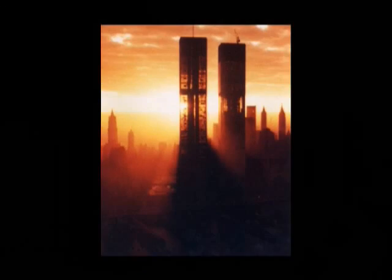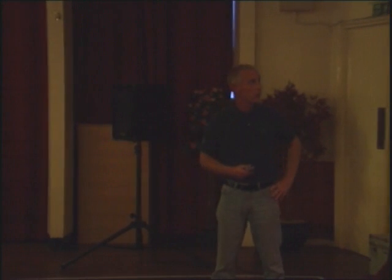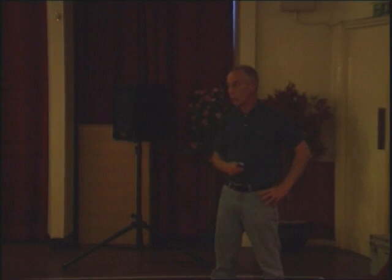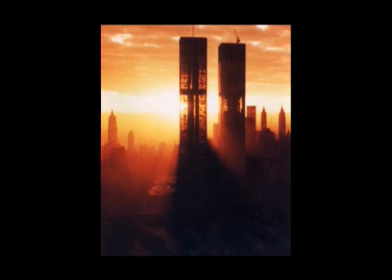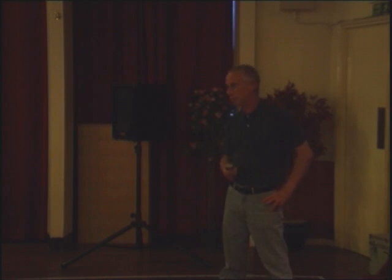What we have is an outer perimeter structure consisting of 60 vertical columns per face, approximately 60. The dark vertical band that we see running up the centre is the core columns. There were 47 vertical core columns, roughly arranged in a 6x8 grid. It doesn't quite work out, but you're basically talking about 6 rows of 8 columns. Some rows only had 7. That was the main beef of the tower.